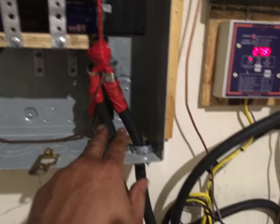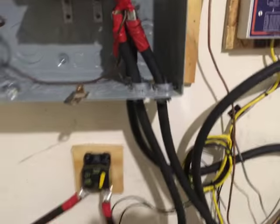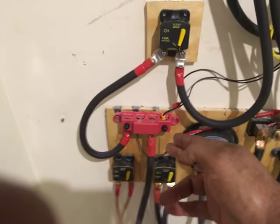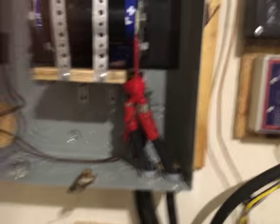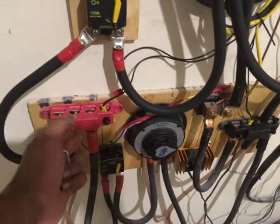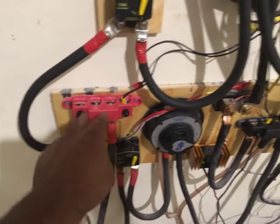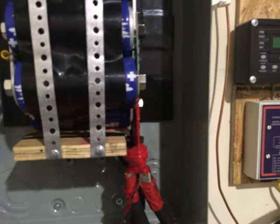This is four-aught cable. This cable here goes directly to the inverter and this cable right here goes through this switch through the bus bar. As opposed to the inverter cable connecting down to that bus bar, this cable here is coming directly off the capacitor bank. So this is the first place the inverter will get energy from, as opposed to at the bus bar where it can get it from the battery bank or the capacitor bank. In this case, it's coming directly from the capacitor.